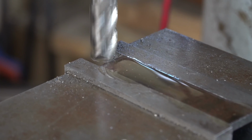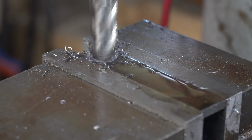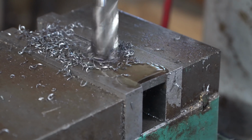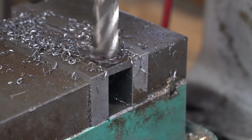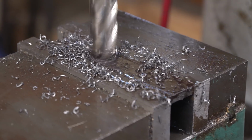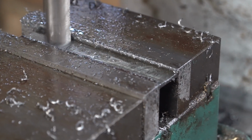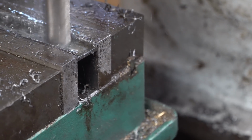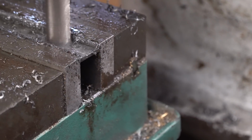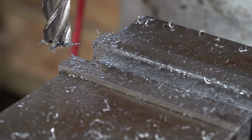That rod is the portion that goes through the main body casting and is adjustable back and forth with the thumb screws. And this portion is the chunk of steel that holds a piece of wood, which would be the wear block that the tooth bars, the back of the teeth, would rest up against and shift up and down. So that's why I'm cutting a slot in a thicker piece of steel, because I'm going to stick some wood in here and give that tooth rod a bearing surface.